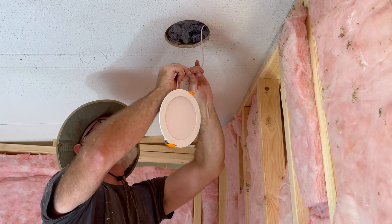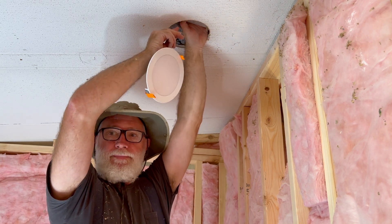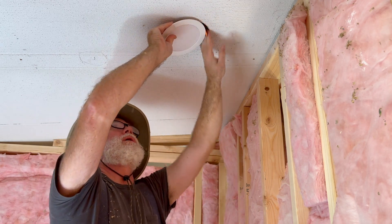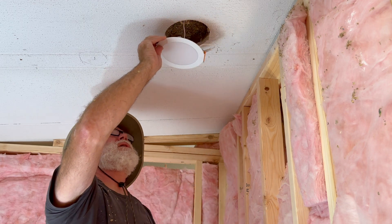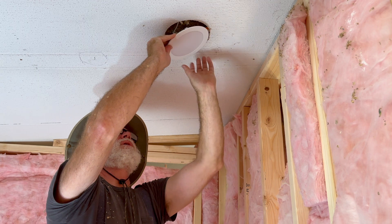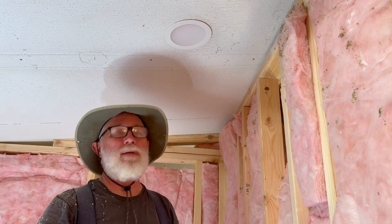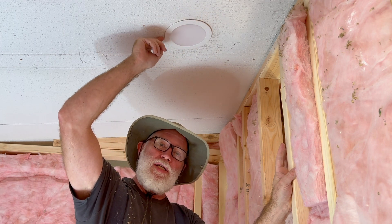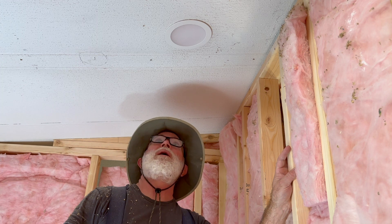There's a little notch on there to help you align the plug correctly, and then the screw goes on. I've got it on the one step down from brightest — we'll know if that's right in a minute, we can always change it. Get that plastic bag out of there, get one tab over, push the other one up, and seat your light in place. Now because this is a shower, I'll come back and put a bead of silicone underneath this fixture. It'll make it more complicated to change the light if it burns out, but these LEDs have a 30 to 40 year life expectancy so I'm not expecting to have to change these out. Siliconing the back side will make sure we don't get any water penetration through there. This should be a good installation and will provide plenty of light for the entire space.